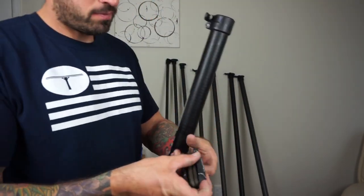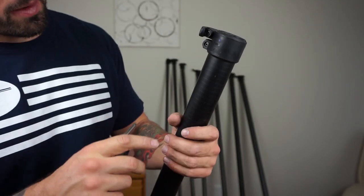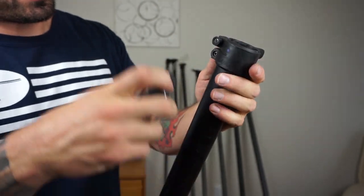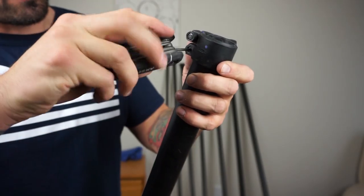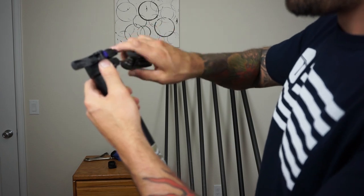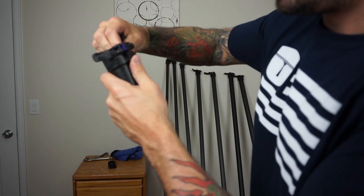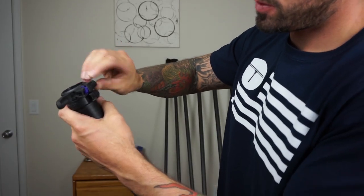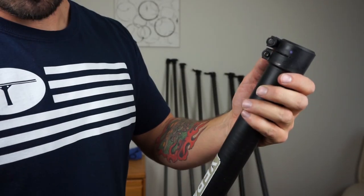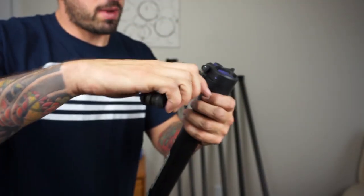Here's exactly how I would change the old clamps to the new ones. Take your Allen wrench and go right in there, untighten it, and release your clamp. I didn't find a need to use vice grips at all — they all came off pretty simply. Twist it a little bit to release some pressure, then take out the screw and loosen it up fully to make it really easy.